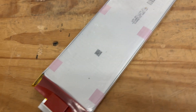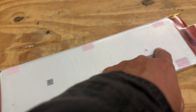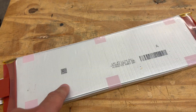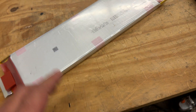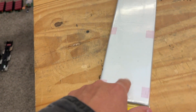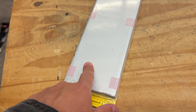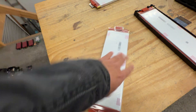These are unused — they're new. What they did is they prepared them to put them in packs but then never welded them. As you can see, the tabs are unwelded and they have all this extra stuff. They're wrapped with this really tough fiberglass tape, and then after that they're wrapped in this clear shrink tube, so they hold their size. You almost don't have to compress them because they're already compressed — they're definitely not going to expand or swell because of that tape.